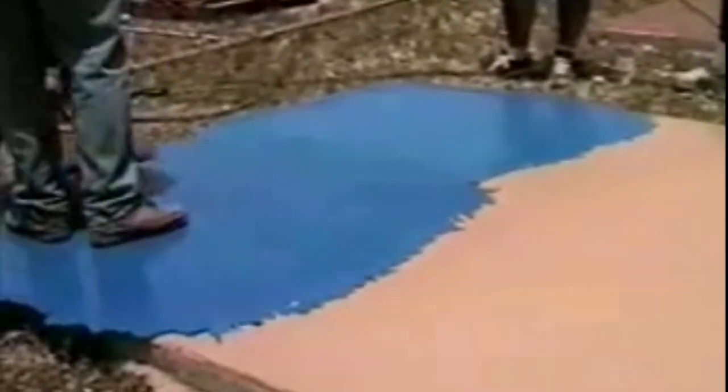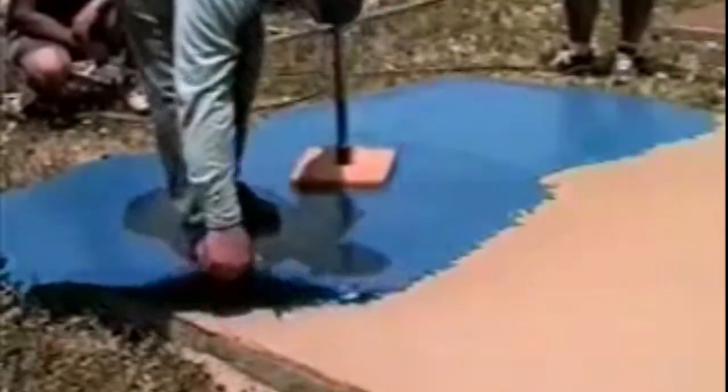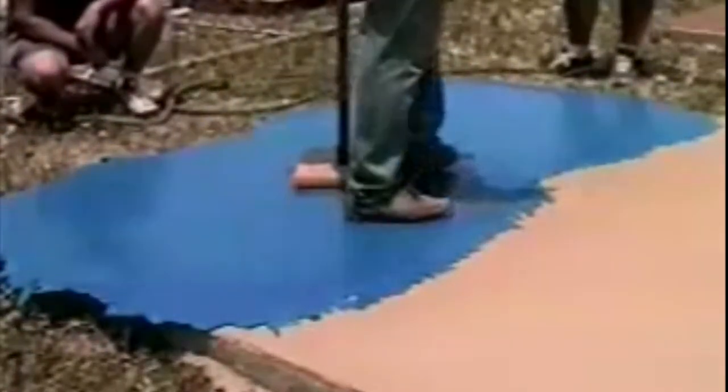As you can see, this mat is extremely flexible and almost five by five in size, so fewer tools are required on the average job. As we tamp the pattern into the surface with an impact tool, a corner of the tool may be raised at any time to accurately determine whether the desired depth of the pattern has been reached or if additional tamping will be required. Now the last tool is removed so we can see the intricate natural stone surface that this pattern tool has provided.